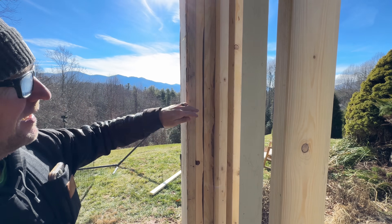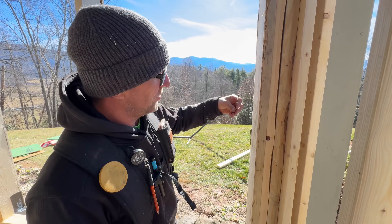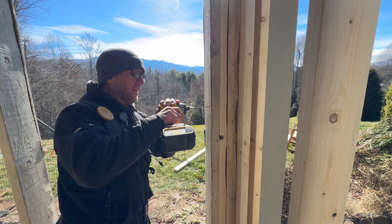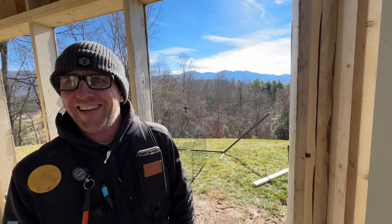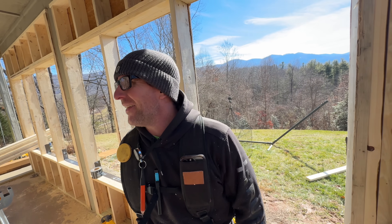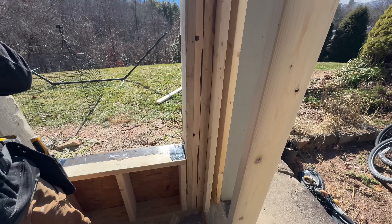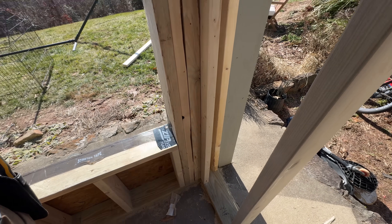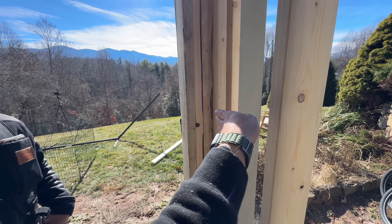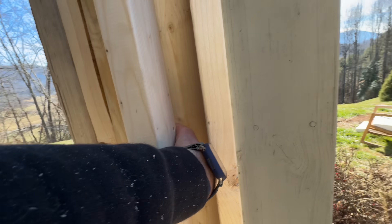Right now we're putting this corner in and this is only a two-inch piece, so I'm having a hard time getting anything to catch there and I don't have any longer screws. So I'm just kind of making my own little four-inch like this. Wow, I hope I never need to take that out of there. That's a deep dive. Not my problem. It caught, though. That's a weird situation we had here too — we had this framing right here and then two inches to this wall, and we're like, how do we do a corner? Ended up having to rip a two-inch sliver and then nail a piece of framing to the back of that to make this inside corner. We ran all the way up too. It will make it a little trickier to insulate, but you can still get in there, which is good.